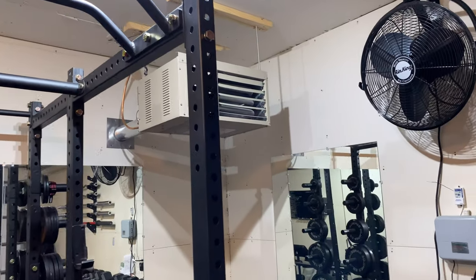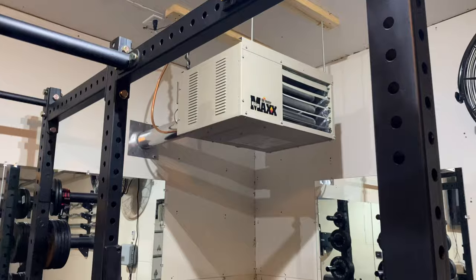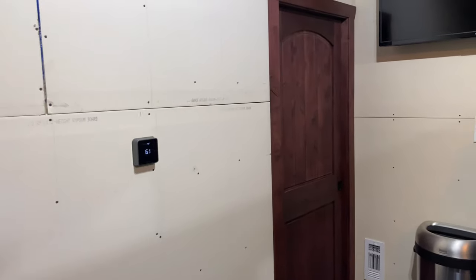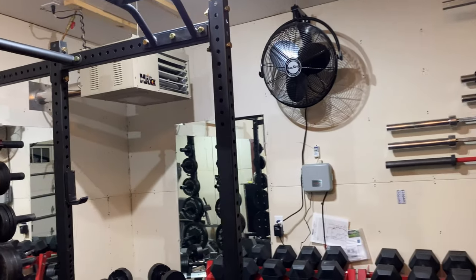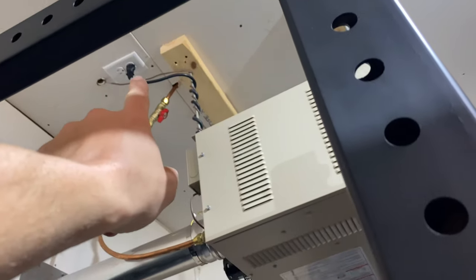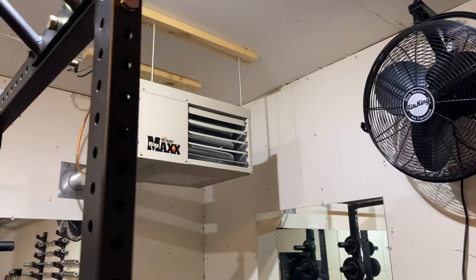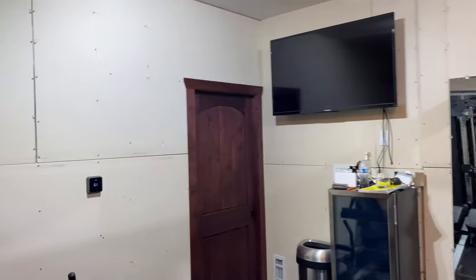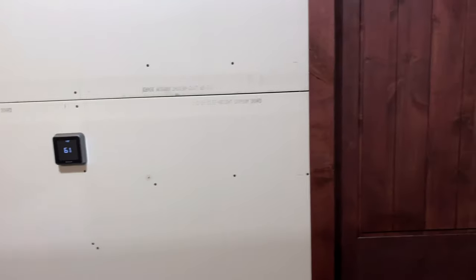I'll have the links in the description. If you have any questions, just ask. If you're a professional with tips, help the people out. For me, from my experience, this thing works amazing. I love that I can keep it warm in here at all times for cheap. I can turn it on remotely from far away with the Wi-Fi — like warming it up for my wife to come home. As long as you can get the exhaust hole cut, the power outlet set up, and the gas line run, somebody can install this for pretty cheap. It's 22 degrees outside and this has been off with the door open for about an hour and it's only at 61 degrees.